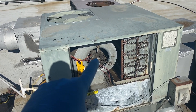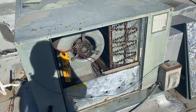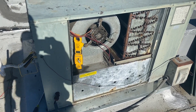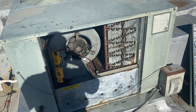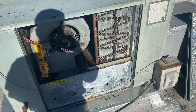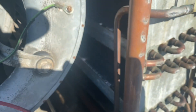So we've got it all figured out — blower motor is dead. We still don't know about the refrigerant, but it's probably fine. The standing pressure is about 150 PSI. Generally R-22 at this ambient temperature, around 80°F, 150–160 PSI is normal. I don't think it's low on refrigerant — it just doesn't have enough airflow across the coil. Low suction with a somewhat normal high side usually indicates an airflow problem. It drops the suction pressure and begins to freeze. You can see it's all ice under there.